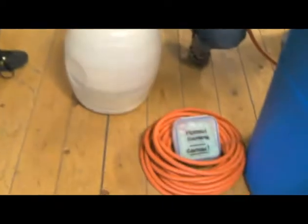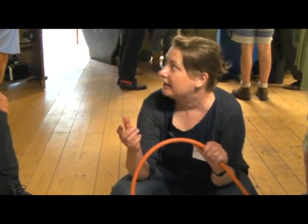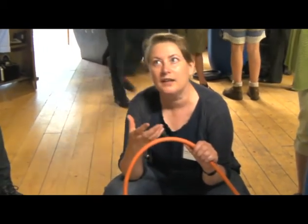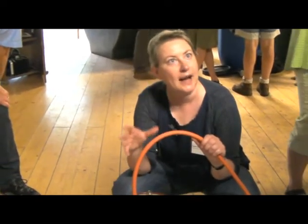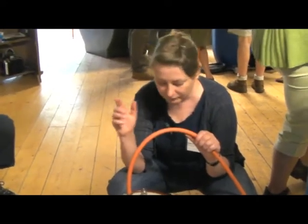In the biogas, there's not only carbon dioxide — biogas is about 60% methane — but there's also hydrogen sulfide as well, which is the stuff that smells like rotten eggs. And that's not good for your lungs; it's quite harmful even in quite small quantities. So we'd really like to take that out of the biogas before burning, because it corrodes everything that it touches as well.